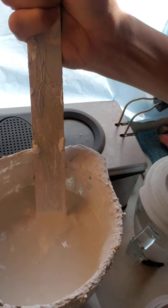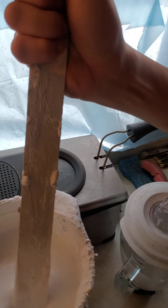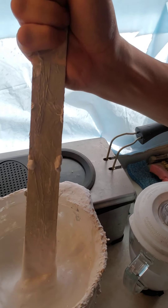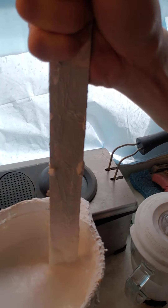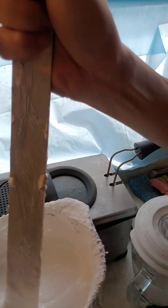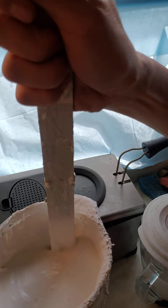Let me show you the mixing here so you can see it has a watery consistency. Some of the other paint I had would come in clumps kind of like cottage cheese, but this stuff here looks kind of like a yogurt consistency with water on the top. Even if I were to dip the paintbrush deep into this and put it on the wall it'll work, but I'm having separation with the watery top and the paint underneath. If I can get this to mix in really well, the paint will be even better and will go a lot farther.